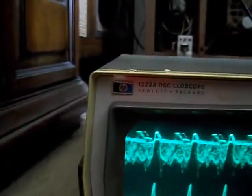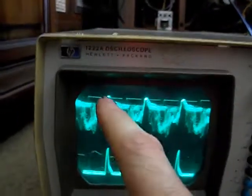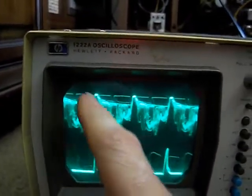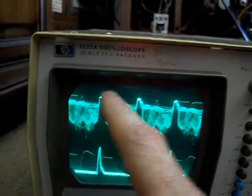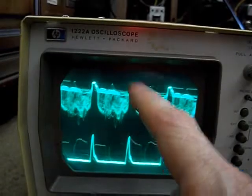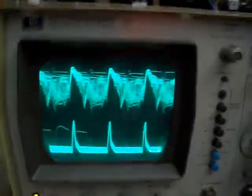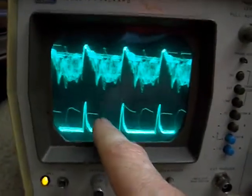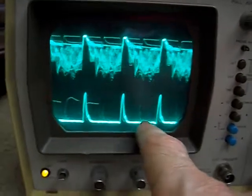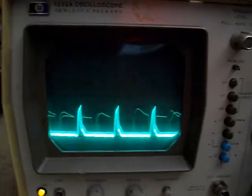You can tune out these little ghosts a little better. Basically what we have here is at the horizontal rate, I'm seeing each scan line, which includes video information here, and then a sync pulse here. This is the grid, this is the plate. Notice how flat this is — it's completely cutting out the video information, or at least it seems to be. Let me turn that off and re-center this up.